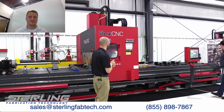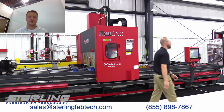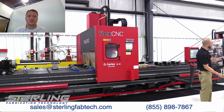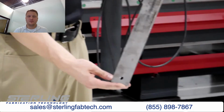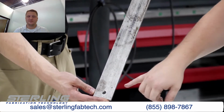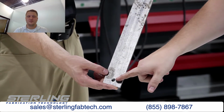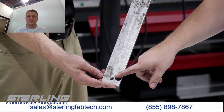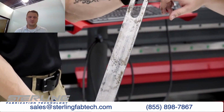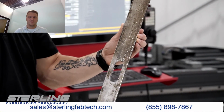All right. Are we going to be able to pull that finished part up by chance? Yeah, I have one. Got one right over here. Good deal. Let's let everybody see what we're looking at. Here we go. As soon as Tiffany can get the camera on it here. They're kind of hard to see, but I have some 1/8 inch holes that are drilled right here. And then we've got the 27/64 drilled hole right in the center. And then up here, we got our 1 inch by 3 inch slot there.